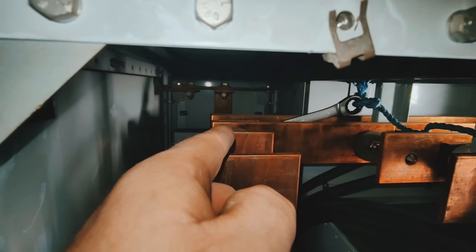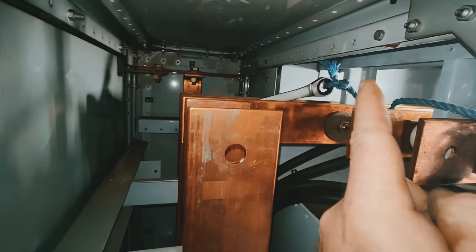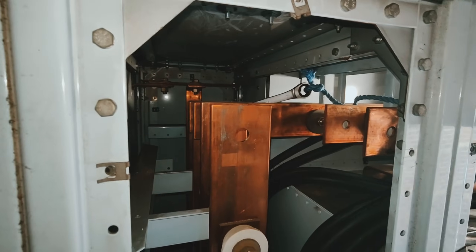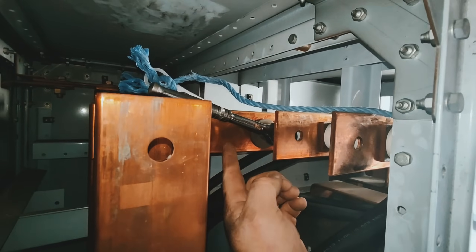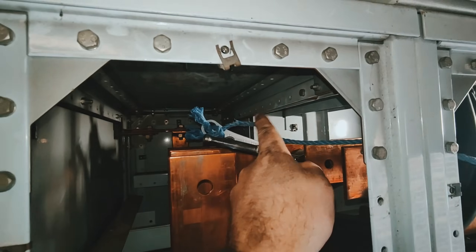So what I'm doing: I've tied the spanner off to the bus bar and then I get two hands on the ratchet onto the nut head, tighten it, and what will happen is that will go up, hit the steel, and then I can loosen it in theory. The other bolt-nut combination - the nut, the bolt head - spins the other way so I couldn't rely on that.